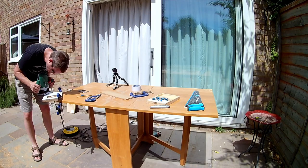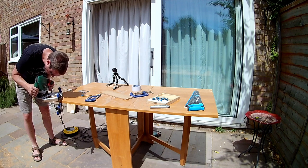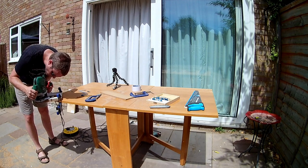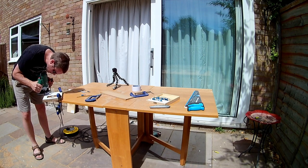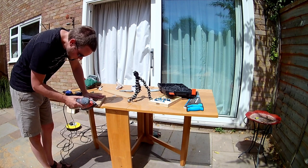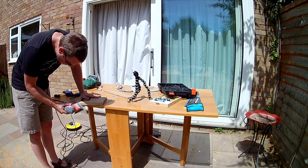While I thought about how to fix the edges, I decided to neaten the project up a bit as a whole by rounding over the front edges of the plaque. For this, I used a round over bit, which is similar to a flush trim bit in that it has a bearing to keep it in the right place, but it has a curved blade instead of a straight one, so this gives you a smooth curve when you run it along a corner. Now that the main cuts were done, I started sanding the front to make sure I'd removed all the glue from the double-sided sticky tape, and it was all nice and smooth. Sanding always takes forever, so I won't subject you to all of it.